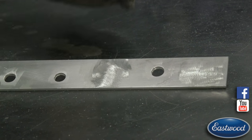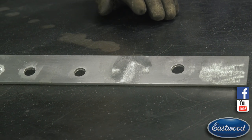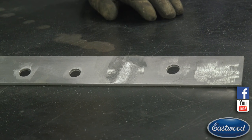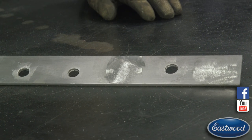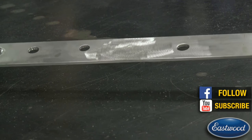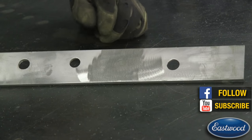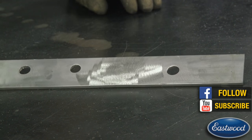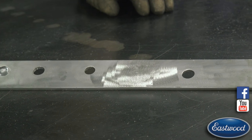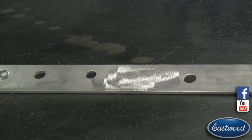So probably what I would do here is take a block, sand it, see where I'm at. You can spray a dust coat or machinist dye on it, and then sand it, and they'll tell you where the high spots are. This is our backside. Same thing. Got just a little tiny halo there, but depending on what you're doing, you can go back and chase those little marks. You can sand them. We could add more to the center all around and build it up and then sand it off.